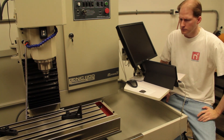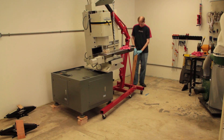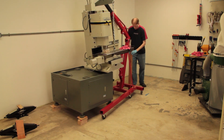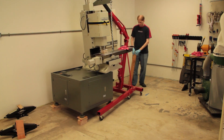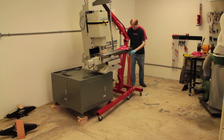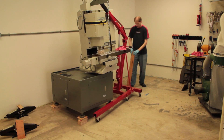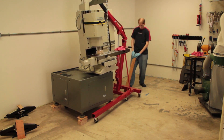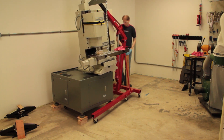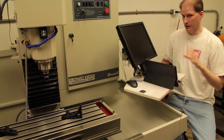There's no need to do that. I actually used a 2x4 and levered it underneath the base of the stand so I could apply a very large force over a very short distance, allowing very fine positioning and good control of the load as I was moving it around. No need to jerk or shove your lift — just get something, lever it from the base, make small movements gradually, and you'll get it there. No need to make the mill swing; that's really scary.